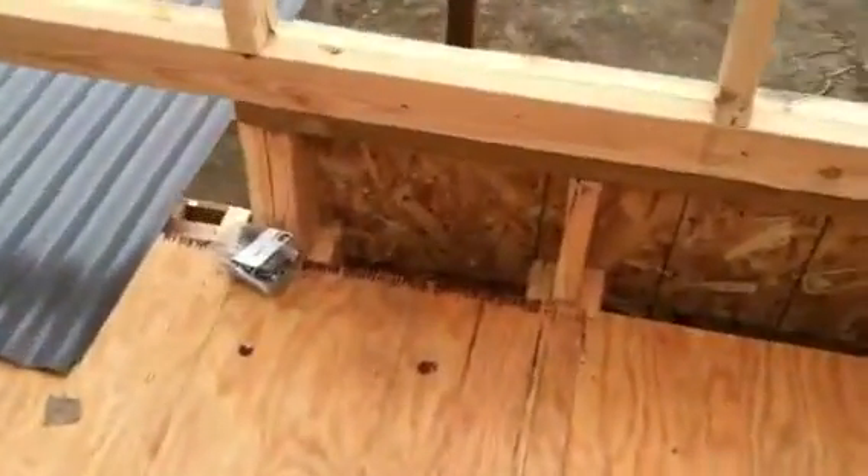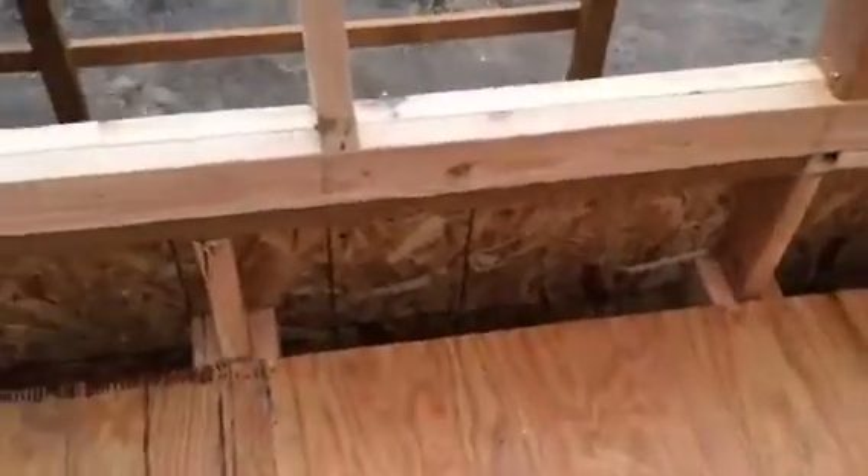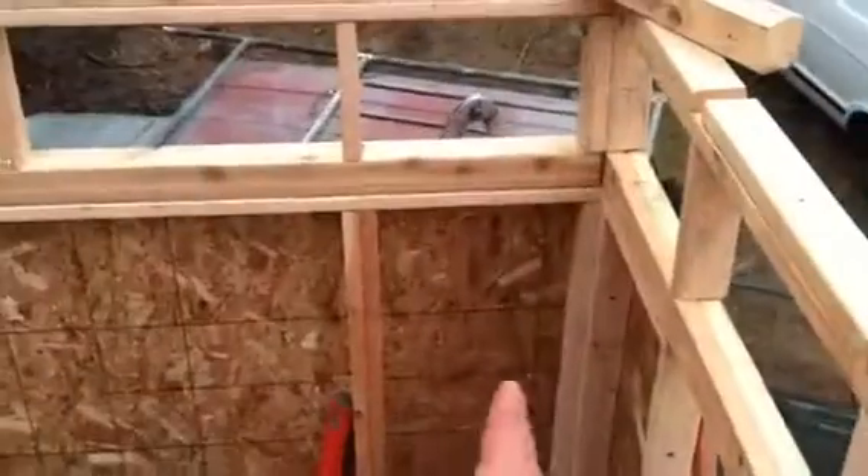Also, in order to save headroom, this floor is supported by 2x4s, but we've got to go with a lot closer spacing. Now because of the spacing I had to leave for windows downstairs, we're a little wider here. And some of those 2x4s end up being 4 units wide down below by the time I get the window frame in, so a lot of these are doubled up.